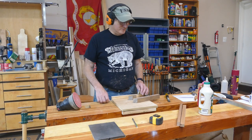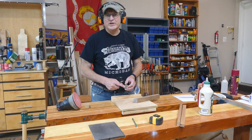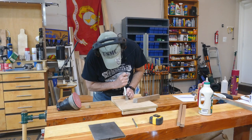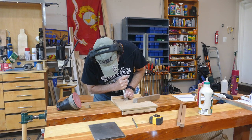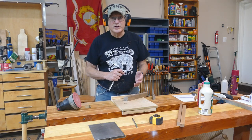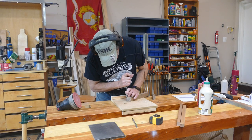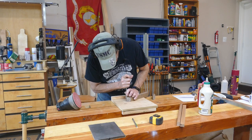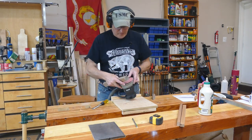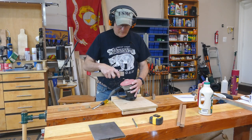I have the 45s cut. Next thing I want to do is take off the sharp edge, because I don't really want that — it'll just get beat up. So all I'm going to do is take the chisel and take off about a sixteenth of an inch. There we go — doesn't take much, probably not even a sixteenth of an inch. I just want a nice little chamfer on it so when the bottle rests against it, it's not crushing that point. Then I'll hit it with some sandpaper and give it a little bit of a round. And that's how simple it was.